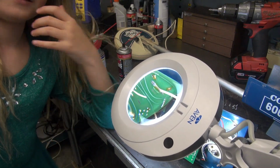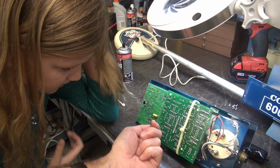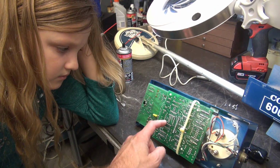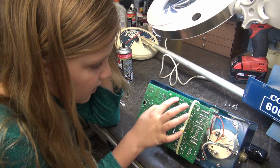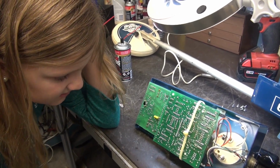Oh, well, sometimes where these parts come through and they're soldered, those are little pins of the parts coming through, okay? So when things vibrate, you can get a crack around a lead where it's soldered to the foils. Can you find one that has a crack, please? Yeah, I'll try to find one. But that's a good question.